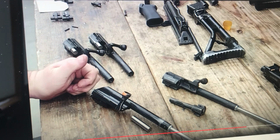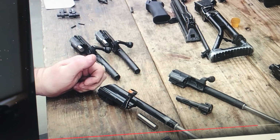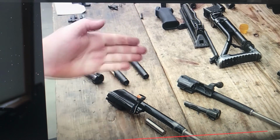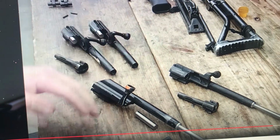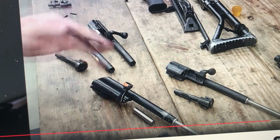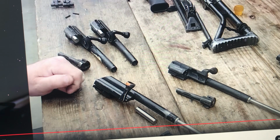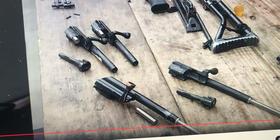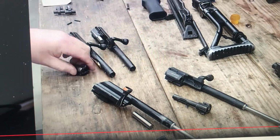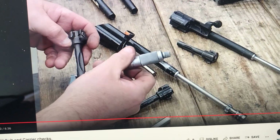In my book, anything past that is a judgment call, but I tend to start looking for another bolt in the carrier that's at least 5 thousandths tighter than that. So, 438, 439, and you want to back that up if you can. The bolts very rarely wear to the extent that they seem to, the stem being the problem. So, you just kind of measure them there.